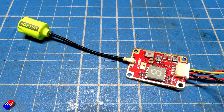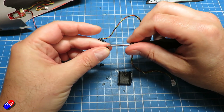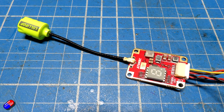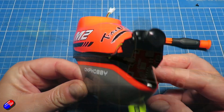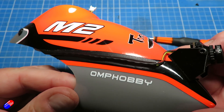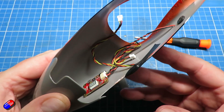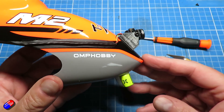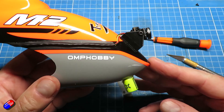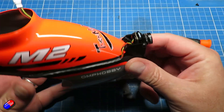The first thing I wanted to do was keep the setup pretty basic for the test — I didn't want lots of complexity. All I need is a video transmitter, an antenna, and a small camera. I also didn't want the helicopter looking really messy when installed — I didn't want it looking like the Back to the Future DeLorean with lots of things stuck all over it. I also wanted to place the camera as far forward as I could on the canopy to help see under the blade disc in flight. The blade disc is pretty big on a helicopter, and it's inevitable you'll be looking through it a little because of the way the CMOS camera shutter works — you will get that wavy line effect — but having the camera as forward as possible will limit that.